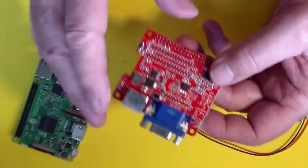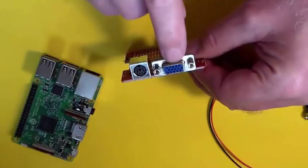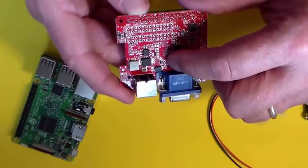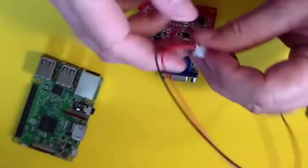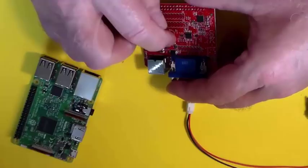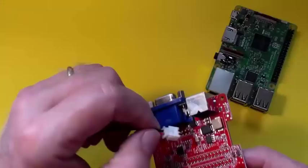There are two ways to get the voltage into this board. One is through this DB15 connector right here. Another way is to come in through these two through-holes — one is ground, and one is 12 volts. In the original board, we just took the JST and soldered it down. But when Brian came out with the UDRC2, he added a component that gets in the way of the socket for the JST connector. In this video, I'm going to show you a much simpler approach to getting this component onto the board where there are other components in the way.